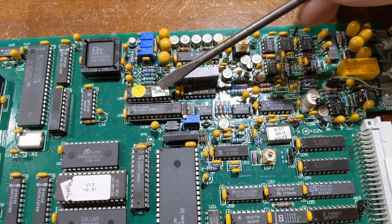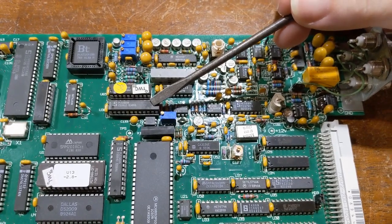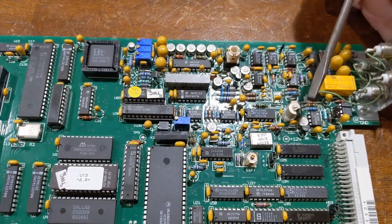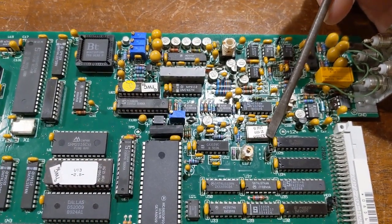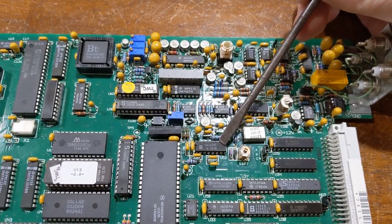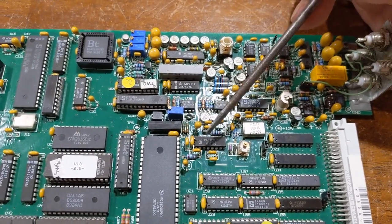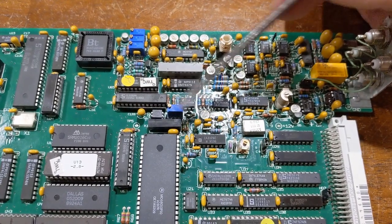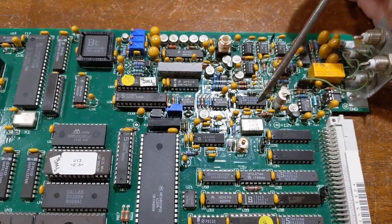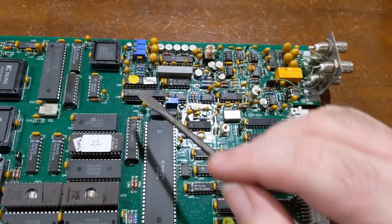This chip here, these are timing chips. Well, one of them is, that generates your horizontal and vertical sync timing and things like that. This other one is a divider network. The way the genlock circuit works is we have a 3.57 megahertz color burst crystal that's connected to this oscillator. Well, this oscillator is also connected to this divider network, so that steps it up to 14.318 megahertz, which self-oscillates, but this can also be PLL locked with the signal coming off of here. So the way it actually works is when you have an input video signal in here, this whole stage genlocks to that